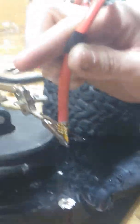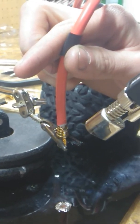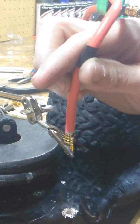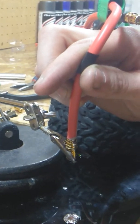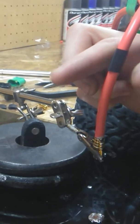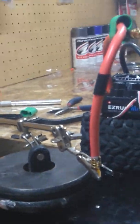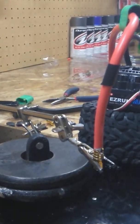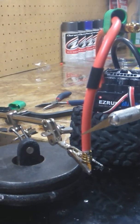Now when you do this, you want to make sure that the wire is straight up and down with this connector — 90 degrees. If you have the wire angled at any way, it will not seat correctly into the plastic part of the connector. That solder is leaking down the side a little bit, but if you only get a small amount it won't do anything — it's globs you want to avoid.